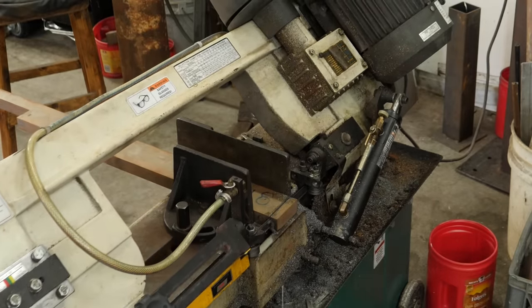I do a little layout on the end of the handle up against the guard, letting me know where I can grind material and where I need to stop. Carbon fiber is difficult to grind, but not as bad as you might think. There are three things that make it worse than grinding stabilized wood or mammoth ivory: the dust is really bad and you definitely don't want to breathe it; it's pretty hard on your grinding belts; and it grinds away very slowly.